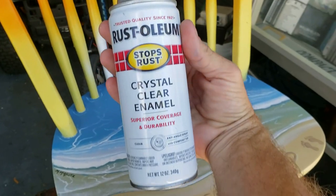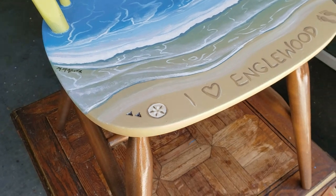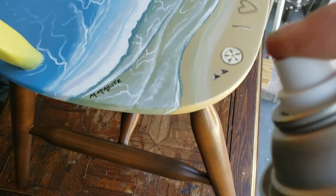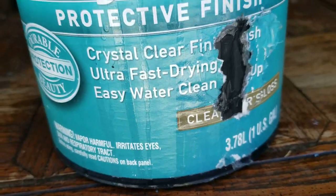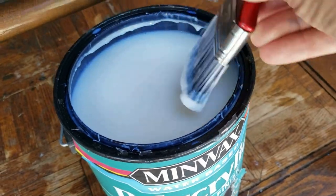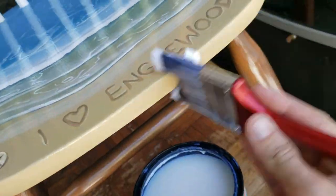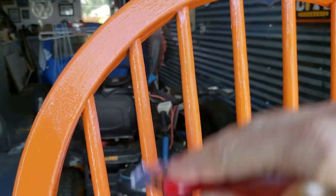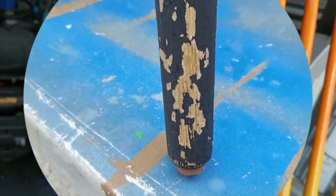I'm trying to get rid of some clear coat in this can, so I figured this is a good time to use it. I'm going to spray it over the whole seat area of this chair and those vertical backrest posts, just in case somebody sits on it — it will be well protected. After that I'm going to do three coats of polycrylic, put it down pretty heavy. It dries crystal clear and nice and shiny. You've got to be careful going around areas like corners where the clear coat can pull up and puddle in tight cracks — make sure it's all brushed out before it dries.